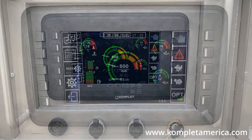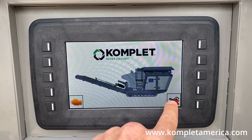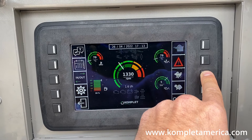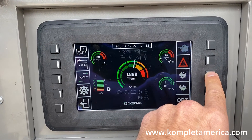The main menu is the default screen that you will need to back out of by pressing the lower left side button, and on this screen make sure the remote controller icon has a red X. Turn the throttle up between 1700 and 2000 RPM by pressing the middle button on the right side of the screen next to the rabbit icon.